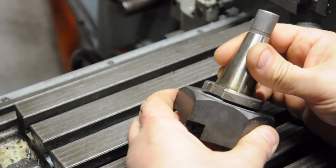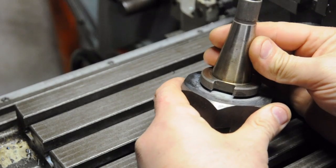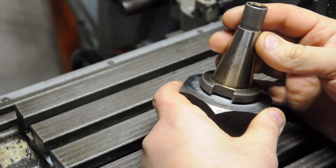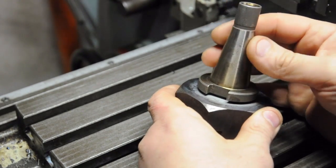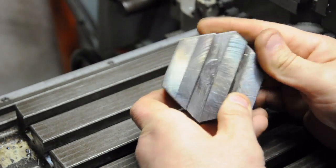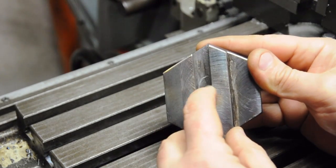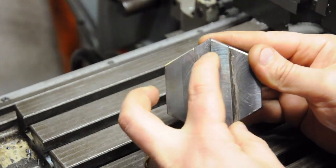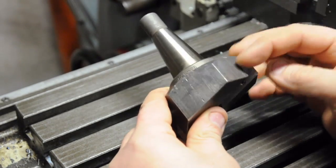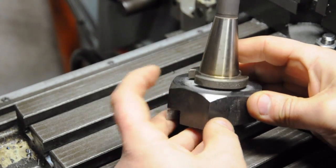To be honest, once it cooled down it felt pretty darn tight. That kind of thing is a little impossible to figure out by hand, but I felt ever so slightly better about things. I did go in anyway and weld the bottom - basically plug-welded it through that little hole we saw earlier and filed it square again. I'm going to hit this on the wire wheel, may cold blue it, and then come back and try it out.